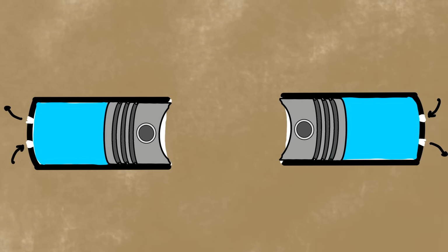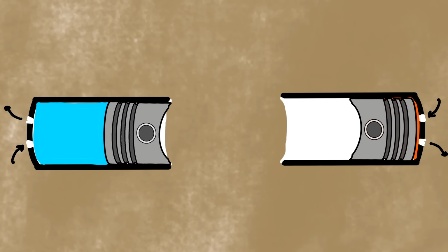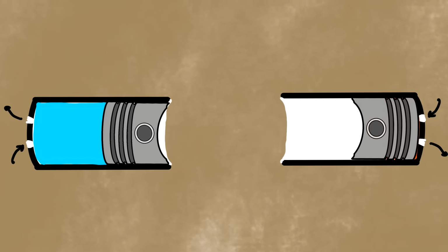Let's look at the other case then, pistons moving together. In this case, the vibrations from inertia basically doubles. But the kickbacks are much smoother because there is now a phase difference between the graphs. So when the piston 1 is compressing and it's requiring a lot of torque, the piston 2 is basically intaking and it's just fighting friction forces. So it doesn't need much. And then they change, and then change again.